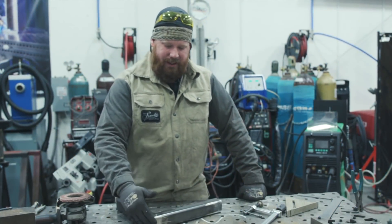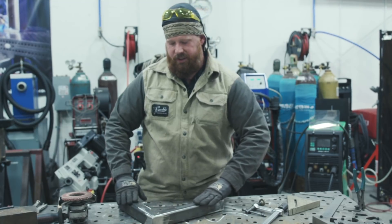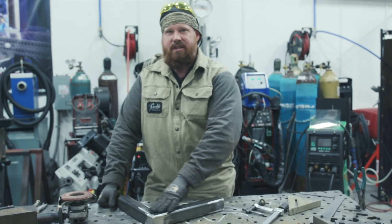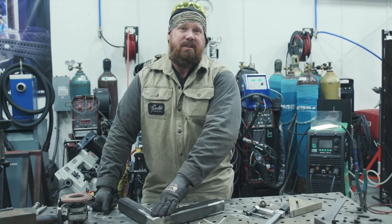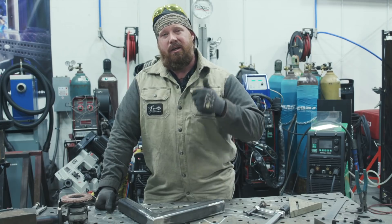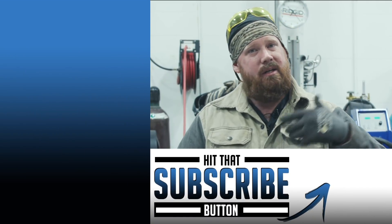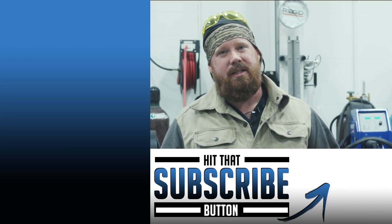Everything turned out nice and clean — a nice 90-degree corner on the outside. Hit it with a DA and some sandpaper to blend the striations, or step up to a higher-grit flapper wheel and you really can't tell those three sides were ever welded. This technique also works with stainless steel if you're going to buff it to a mirror polish. The key is to avoid any undercut or underfill — if that happens just go back, fill in a little more weld metal, and blend it out again. Hope that answers the question! Drop any comments below, don't forget to like and subscribe, and until next time — make every weld better than your last.